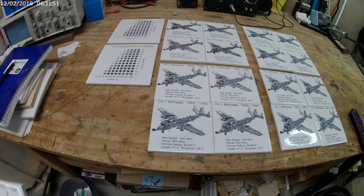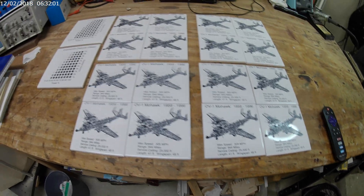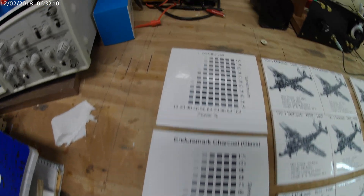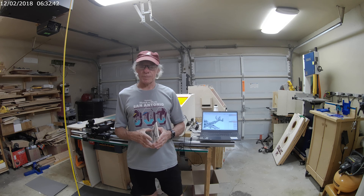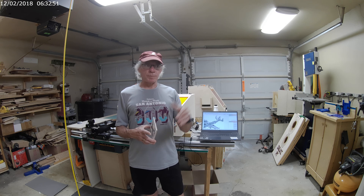As far as consistency, here are sets of tiles I did, all with the same method. If some have been darker than the others, it's just because I used a different speed setting for the burn. I'm actually very happy with this system. I haven't done any real grayscale photographs with it yet, but for this type of graphic, if you have to do tons of these, you're good to go. The one I just sprayed is ready to go into the laser right now. I've had the mixture going for about a week and it's lasting forever — did all these tiles and it's not even halfway through the bottle. Cost efficiency, I think it's very good.